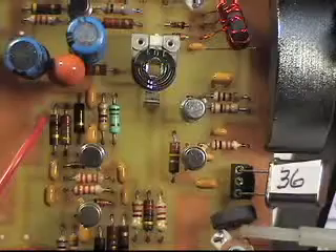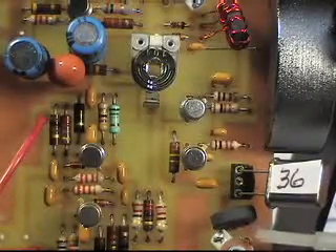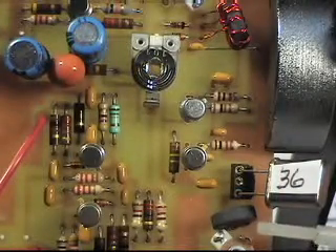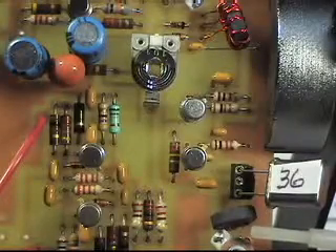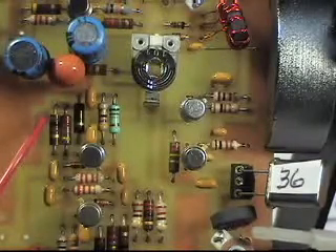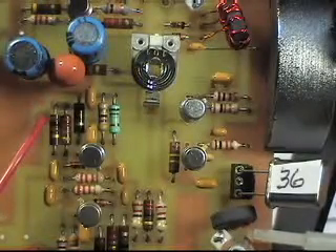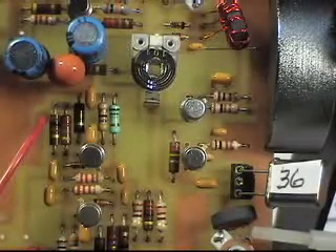The other change I made is I didn't wind 70 turns on a tap washer — I used an Amidon ferrite bead, and this is only about a dozen or so turns. I don't remember exactly; I measured them. I will do a section of video on winding both the inductors and the toroids here in the next week or so.